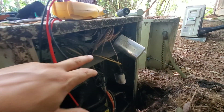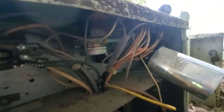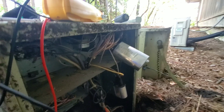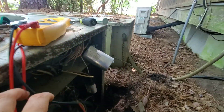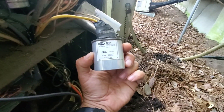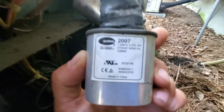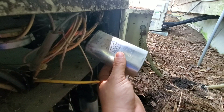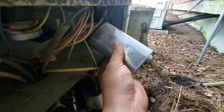1984 — appears to have the original compressor in it, hell, appears to have the original contactor in it by the looks of it, and probably an original defrost control. Looks like the old E15 control. The only thing that looks like it's been swapped out is that condenser fan motor up there. We've got a separate dual run — 7.5. This looks to be our problem right here — swole up 35.